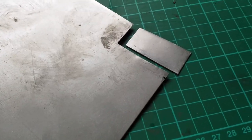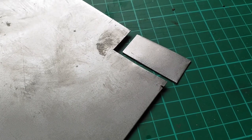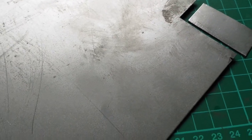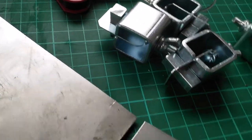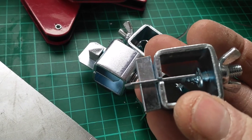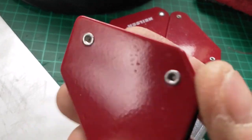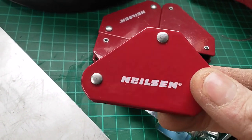To start with I've got some roughly 20 gauge — just under a millimetre thick — sheet steel, and I'm going to have a play with welding a corner back on, but I'll probably start with running a few beads on the metal first. I've also got some clamps — these little clamps allow you to hold two pieces of metal close together for a butt weld with about a one millimetre gap, which is supposed to be about perfect. I've also got some magnetic clamps from eBay to hold things nicely, especially when dealing with corners or right angles.